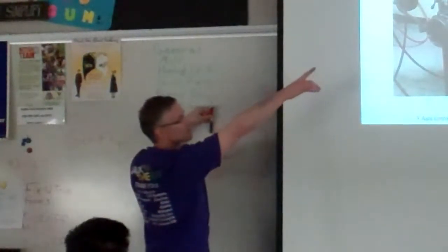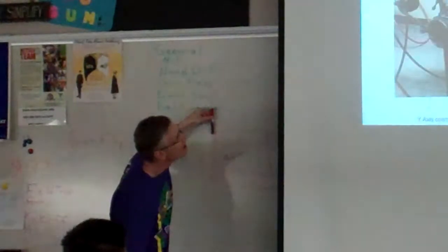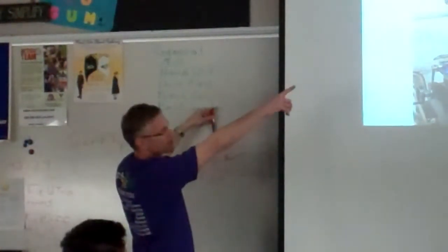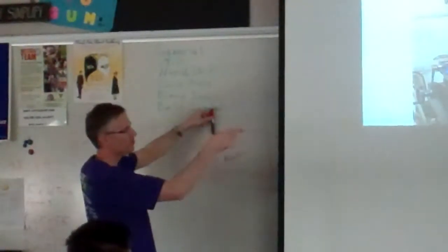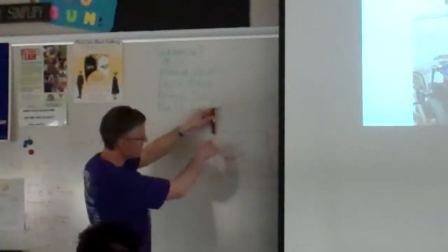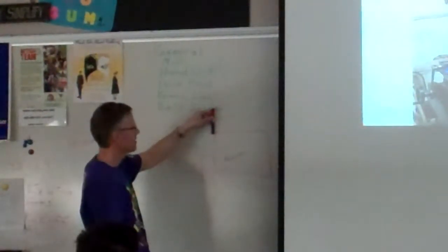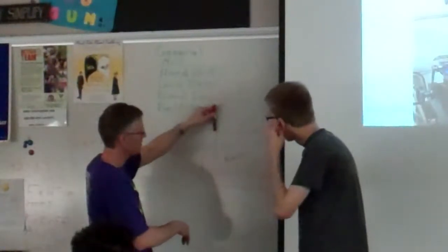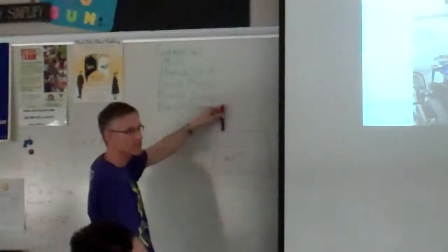So what you do is you go to the digital readout, which we can't see right now. There you go. Here's the digital readout. There's an X0 and a Y0, depending on which way you're looking at it or which way you're trying to zero it. Get it right to the piece of metal that you're going to cut. And you hit X0, for example. Well, now the machine is referenced, so if you go 0.25 forward, okay, it's going to cut into it 1/4 of an inch, and so on.